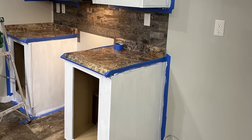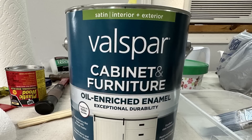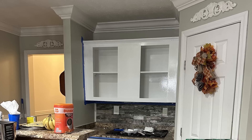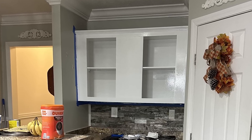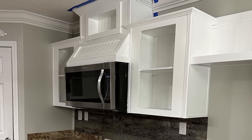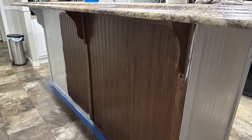This is how it's looking after the second coat of primer. Then I'm going to use Valspar's Cabinet and Furniture Oil Enriched Enamel Paint. This is a satin finish and it is ultra white. I'm going to apply it the exact same way I did with the primer using a separate foam cabinet roller and an angled brush. This paint is self-leveling so it gives you a perfect finish and does not show any roller marks or brush strokes. I purchased this from Lowe's.